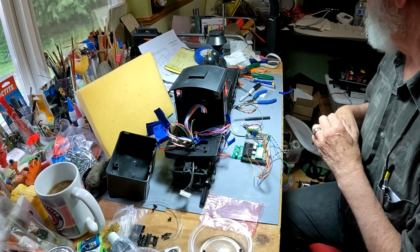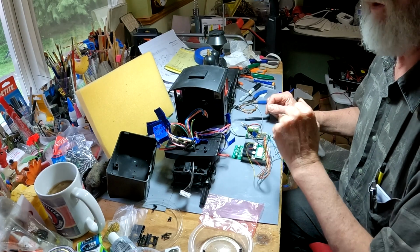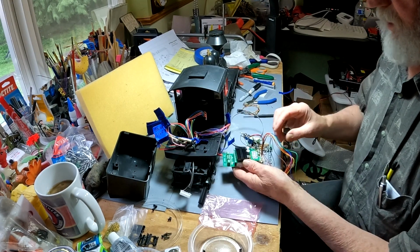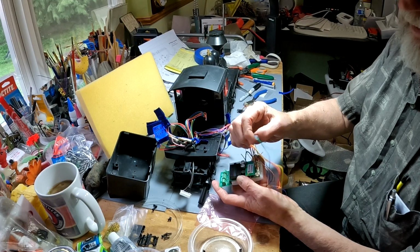My switches are all on the tender and each of the two tenders. The tender here will have a couple, and the tender back here will have those for the battery power. So we'll be pulling the wires, this wire loom, through and getting rid of it. Then we have the train engineer hooked up here, the Revolution train engineer. We only use the blue and green wires, which are your bell and your whistle.